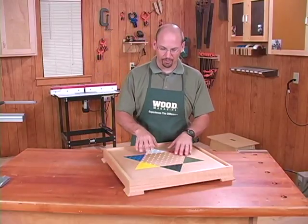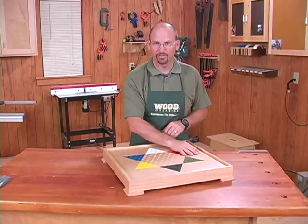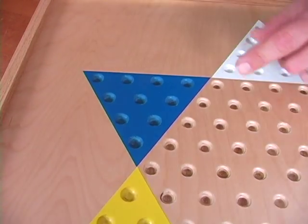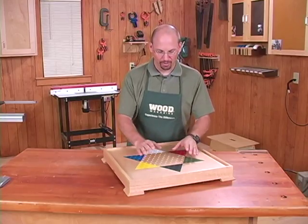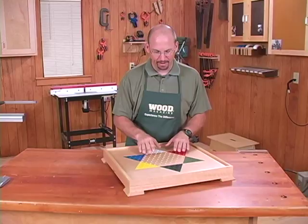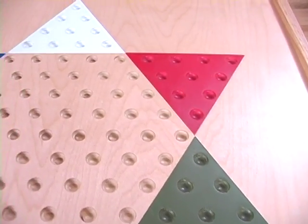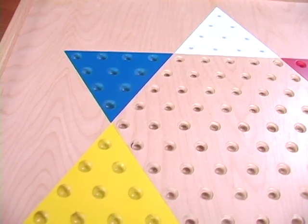When applying the finish to create the colors on the top, it may look a little intimidating, but if you apply a clear finish to seal the wood, then mask off and paint each individual area with a can of spray paint, and then a clear coat over that seals it up really nice. When masking off the top, you can apply color to three different areas at one time — mask off the three areas, spray, let that dry, remove the tape, and turn to the next three. So you don't have to worry about six different spraying applications taking forever to get done.